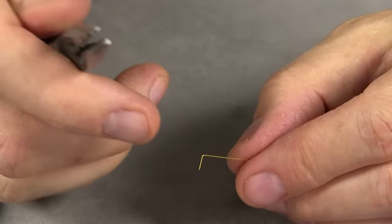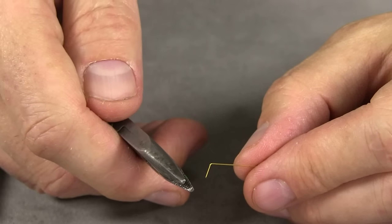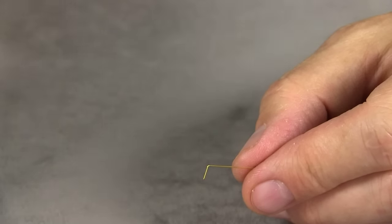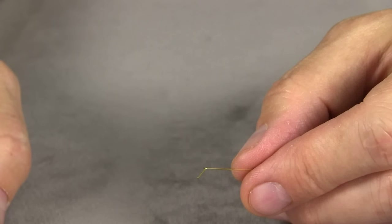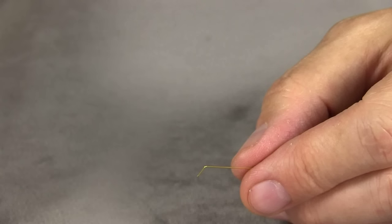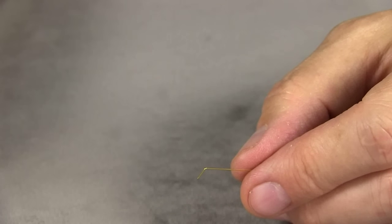This one is sharper, so it's good for making sharp bends — nice small jaws, very crisp. If I want to make a softer bend, I might use these older ones. The edges are kind of worn off, so it makes a more rounded bend. You could also file the edge of plier jaws to create a tool that makes roundish bends. There are also special bending pliers with shaped jaws, but I just use these.